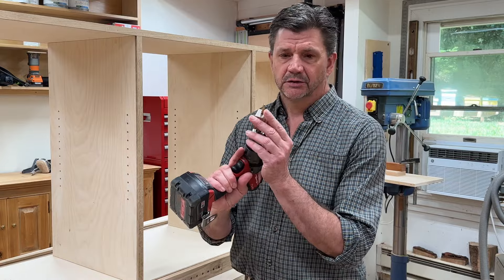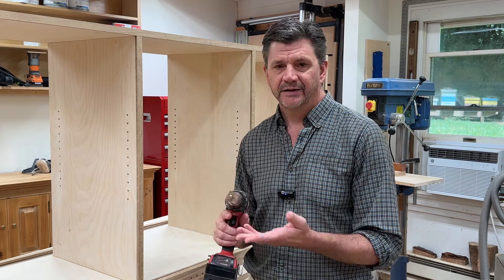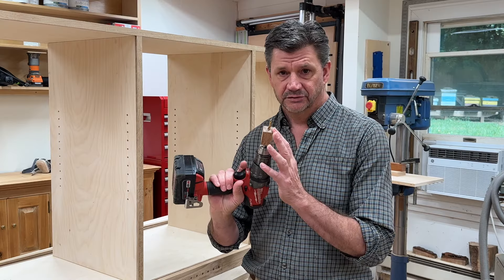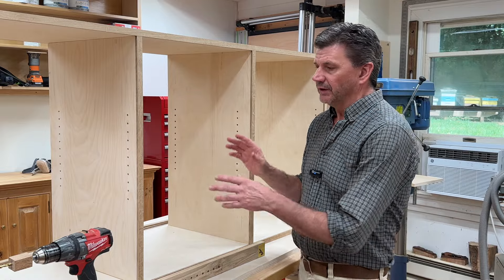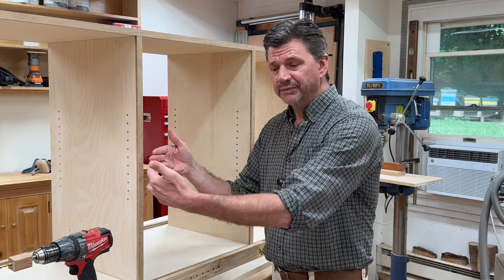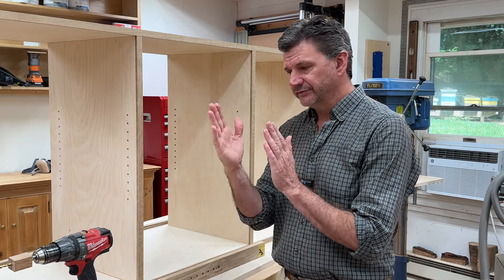You want to use a good sharp drill bit. I recommend Montana brand tools — they're made here in the USA and I've been using them for a couple of years. I'll have a link to the drill bit set. Also, you need to stagger the holes if you've got two cabinets next to each other. You wouldn't want to drill the holes in the same space or they would meet. In the center cabinet I pushed the jig back a little bit so they're just offset maybe a half inch to three quarters of an inch.